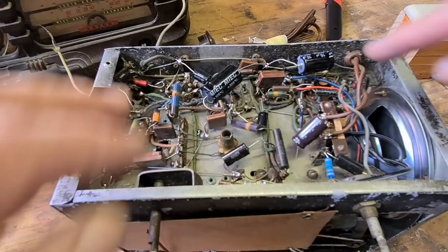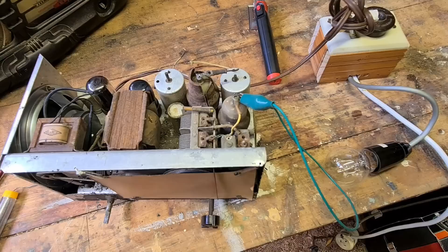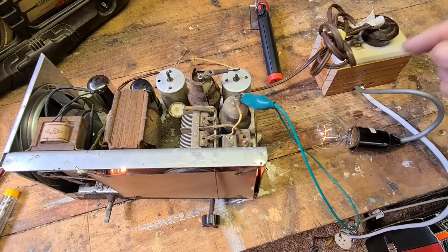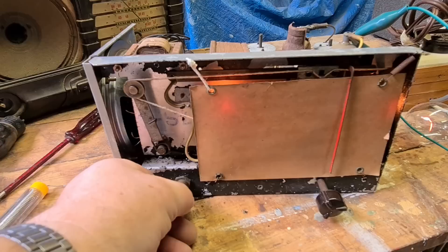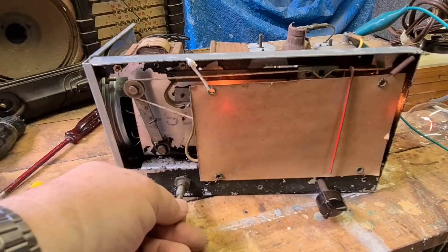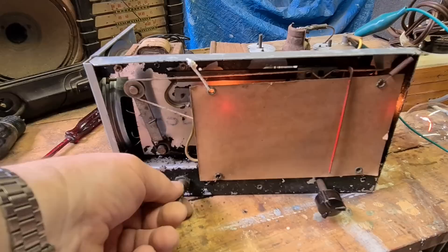Everyone travels around Australia with capacitors in their pockets — so I've just soldered two filter caps in. The old filter caps are still in circuit, but they don't appear to be shorting out. I've soldered the wire back on the top of the cap and pinched the 6A8 valve out of the Astor JJ — it's the same valve. Turning it on — there's a buzz, but it's clear. Whoever changed those capacitors was so close; all they had to do was change the electrolytics and get the old ones out of circuit.